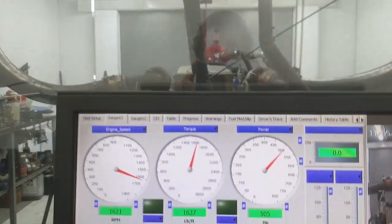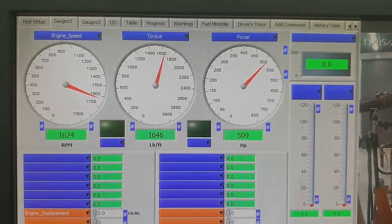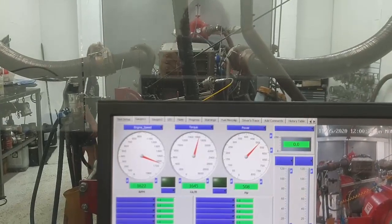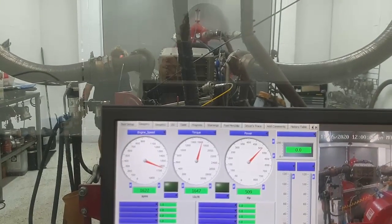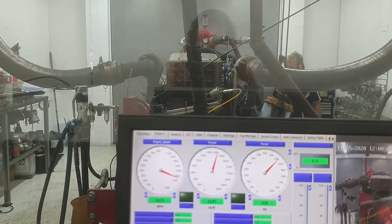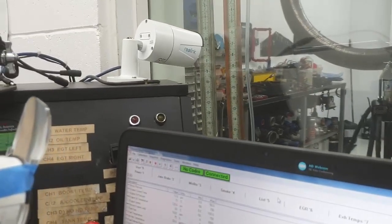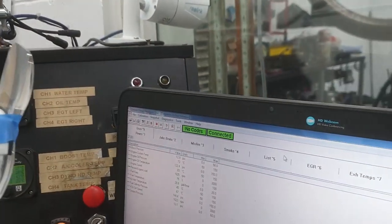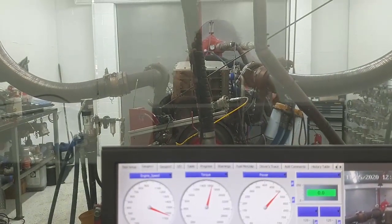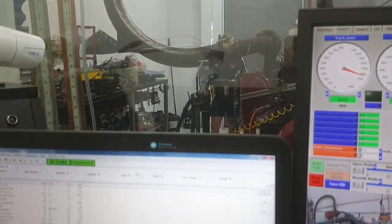The proprietary data link failure was being exacerbated when we went to a variable speed setting between the two ECMs. The master was pretty much trying to hold the exhaust temps to 300 and the slave was trying to pull it up to 500 — one bank was pulling against the other, creating the same horsepower but without proper communication. If it wasn't for the dyno, you probably wouldn't know in service unless you ran it above 700 horsepower or had pyros in both banks. In the end, just one 14 cent resistor brought everything back and married everything up. That fault code is now gone and we're running nicer with no codes.